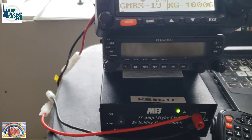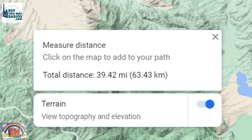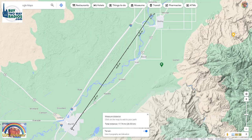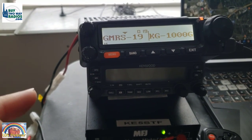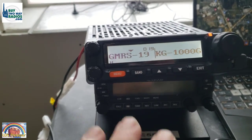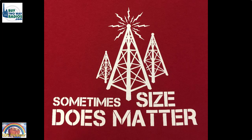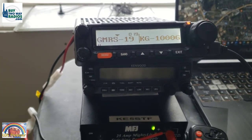Brian is building this house, about 50 miles from his work, and wants to communicate in case of emergency with his family over those 50 miles. Yesterday I called a friend who has a GMRS radio and external antenna, and we reached from here to Blackfoot — approximately 18 miles. He could hear me perfectly clear, but he never broke squelch. He was on a 5-watt handheld with an external antenna and did not break squelch even with my squelch down to 2.